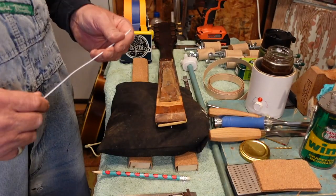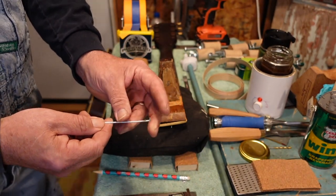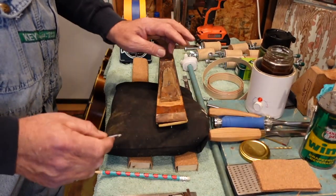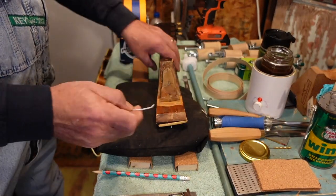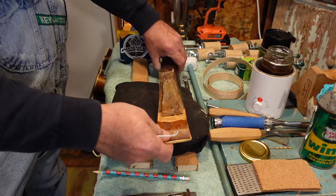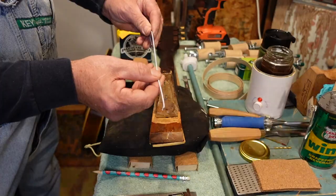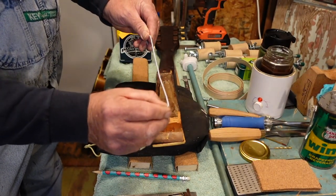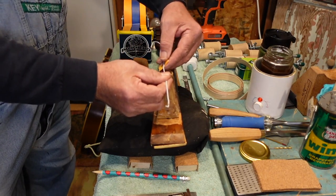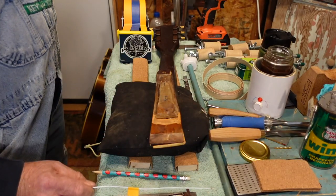Let me show you a little trick. You can take a piece of coat hanger and bend the end over. When you bend the end over, it can't be so much that it won't fit through the hole that you drilled for the bolt, if you follow me. So once this is glued on, you drill your hole this way, because you'll have a pilot hole showing you where to go. Then once it's inside the guitar, you push this through until it's free, then turn it just a little bit and pull it, and it will hang on the edge of the hole. That part that's sticking out, you just take a piece of tape and put it here, and that will tell you what size bolt you need from the hardware store. Are you with me? Did you see that piece of tape?